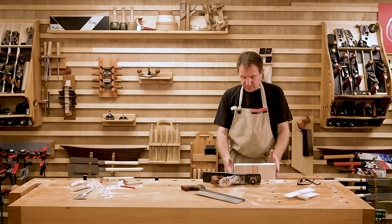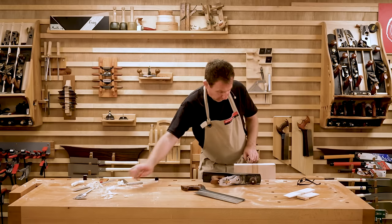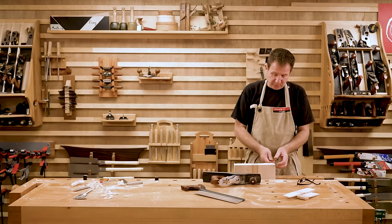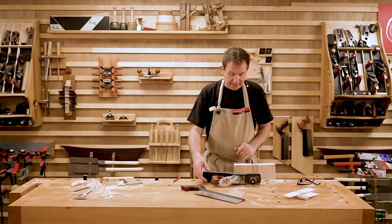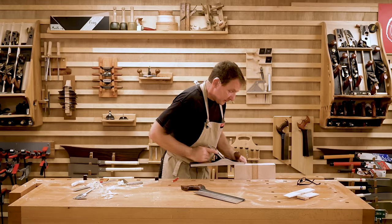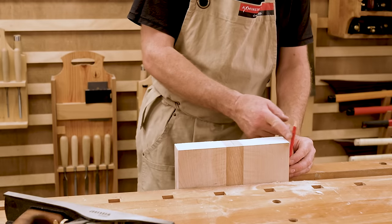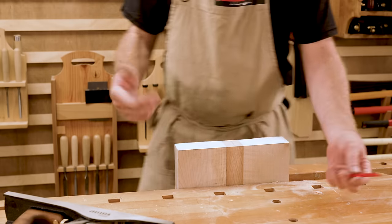At the moment we have vertical grain, this is all end grain. Can plane across it, but actually I want to plane in reality probably to the middle from either side. I don't want to be coming off the far end or the fibres here are going to break off. Alright, so we'll get the plane, we're going to come across, now I've got to get my square, start monitoring. With it being end grain, nice and sharp, gentle movements. If we come all the way across with the plane, the upright fibres are going to break out, so we're going to plane almost to the middle from both sides, come in, and check it's square, everything else.